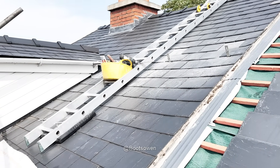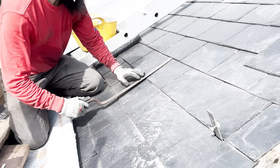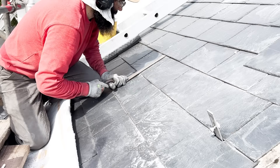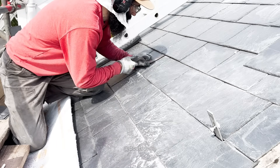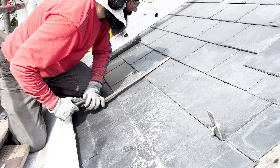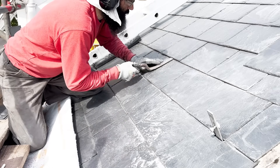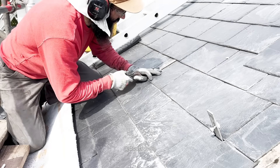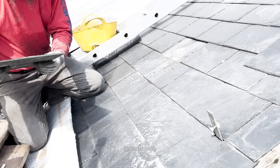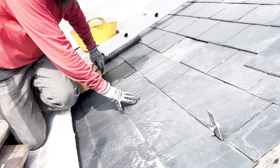Then about 20 to 30 minutes each after that. It'll take me longer because I'm making a video, but I'll crack on. Here's the rip — you slide it up under a couple of slates above the one where you need to make the hole, feel for a nail, and then pull it down hard. This was an easy one relative to some of the others, but if you can't get at it just use a hammer and beat up and down. If you google or search YouTube for 'how to rip a slate' that's how you do it, and it worked out — I'd never done that before I started this morning.